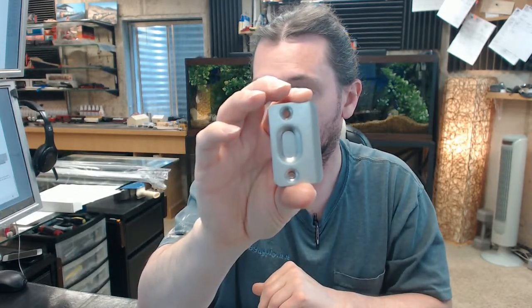Before you go mounting this, if you're installing it in a single door and going to attach dummies or flush pulls, like we said earlier, take an audit of the rest of the space and make sure that you're mounting this at the same location as your existing locks and their strike plates. You might have a long corridor of offices, and then you're going to have a closet door on one side, and you'll be tempted to mount the hardware right where you put this, your flush pull or your dummy trim, and you don't want to have your line of sight interrupted by an unusual height of where you end up installing this. Very typical sort of installation. Made of zinc is the material it's made of.